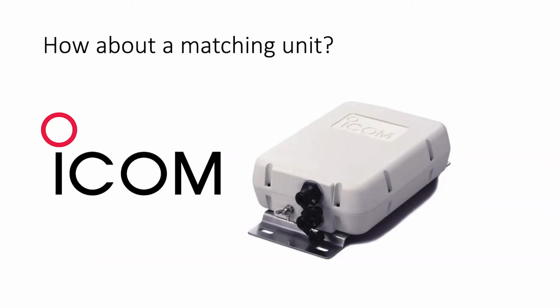And in fact, Andy knows a chap some years ago, used to be a member of the club. He had about 100 foot of coax, and wondered why he couldn't even get across town. I think, Andy, if I remember correctly, he had 130 foot of wire on the end of the coax. So he thought it would work. But of course, it was all being shunted in warming up the coax. So you have to be very, very careful.